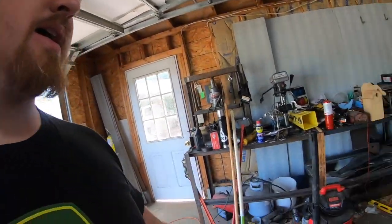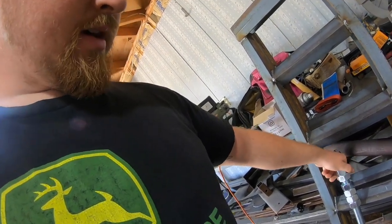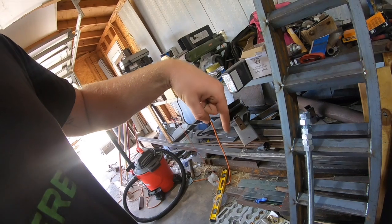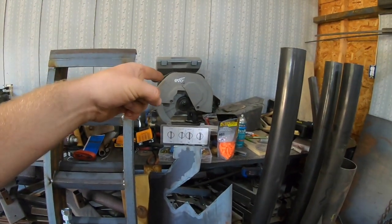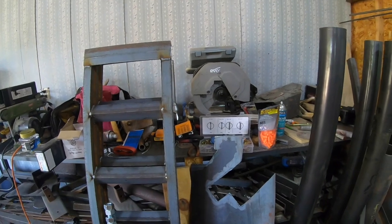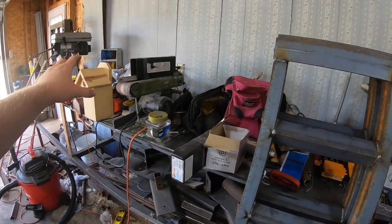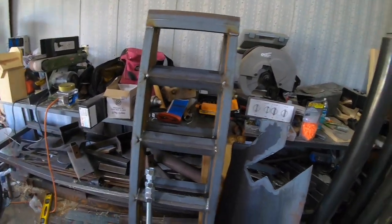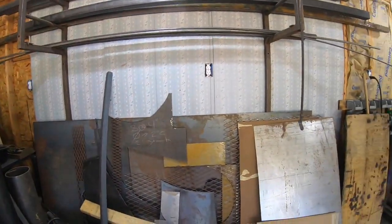What I'm building today is my version of fab stands. Basically, I'll cut this threaded rod into three one-foot sections, weld a nut into some pipe, weld some feet on the pipe, and weld the top onto another nut. One of them will hold my chop saw all the time. This whole table full of stuff was originally supposed to be a chop table, but it takes up a huge footprint for something you don't use all the time. I'm going to build it on jack stands so I can move it outside for all my cold cutting.